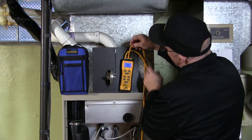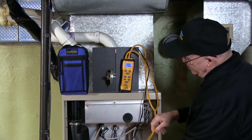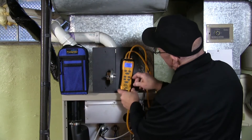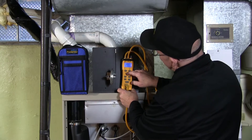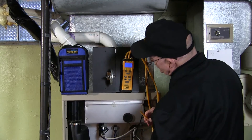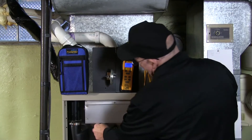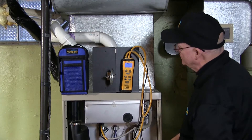I'm going to plug one of the tubes onto that tube — you can see it should look like this. Before I connect it onto the pressure switch, I'm going to make sure it's zeroed out and turn the pump on. I'll disconnect the tubing from the pressure switch and plug onto the negative port of the pressure switch, which went to the inducer.